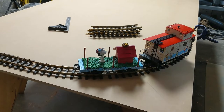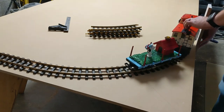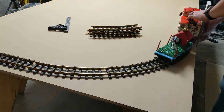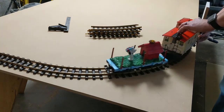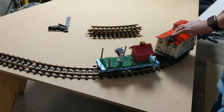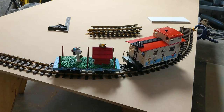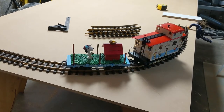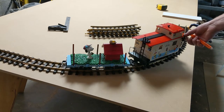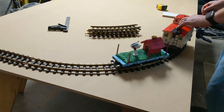I'm going to hold up a board as if it's the wall, perpendicular here. So that doesn't work. We're going to check if we can go in one and a half inches, and then we'll check two inches. One and a half was still too tight — it was just barely rubbing. So we went to two inches, and that works great.